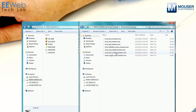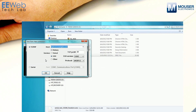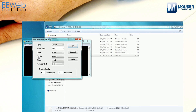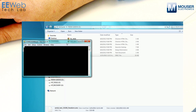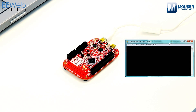There are also a couple of examples demonstrating serial port functionality. I'm going to load the serial_test_19200 application. As that copies over, I'll launch TeraTerm, select COM6 under serial ports, go to Setup > Serial Port, and change the baud rate to 19200. On this application, you can control the RGB LED using the numeric keypad. Press 9 to turn on green, press 6 to turn on red, press 3 to turn on blue. You can turn on any combination at the same time to make a variety of colors.